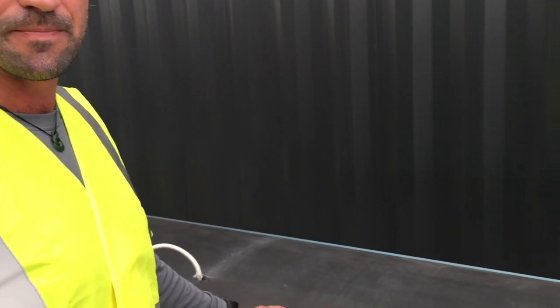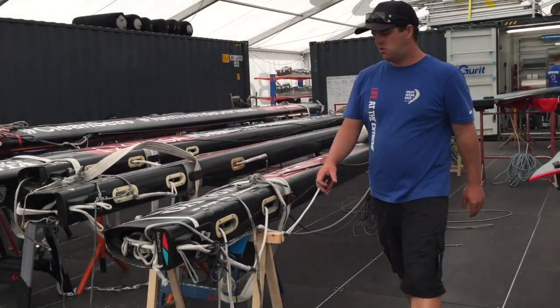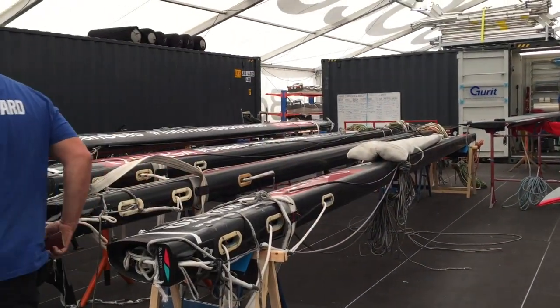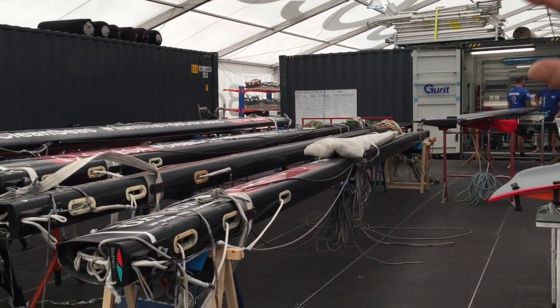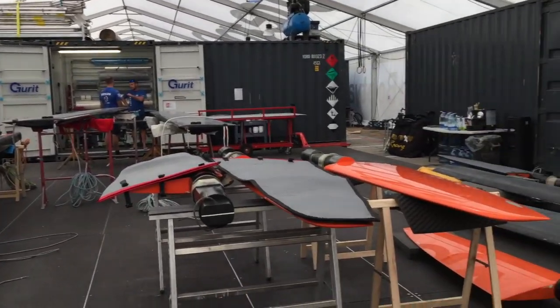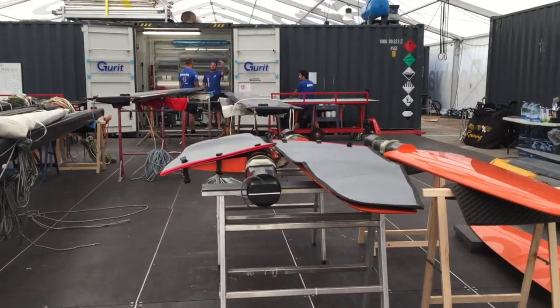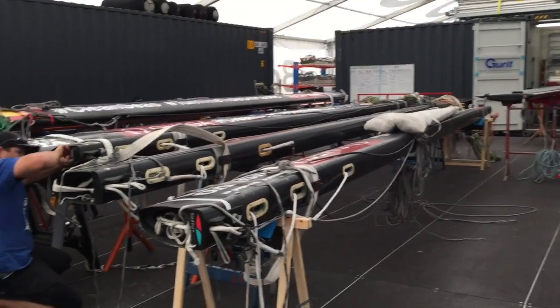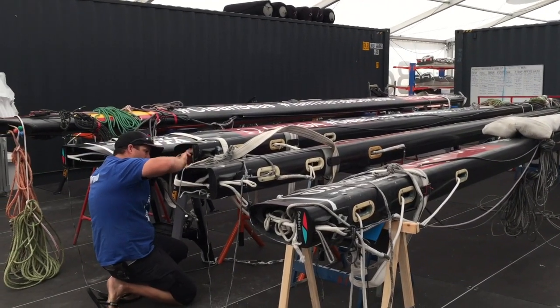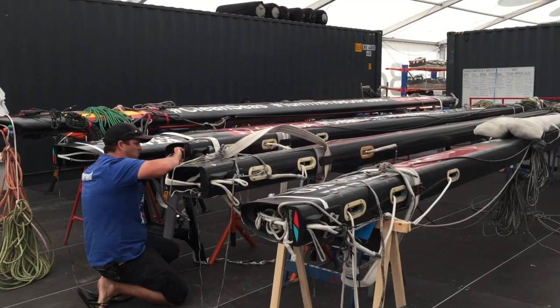The foils are all taped up here for repainting on the leading edge so you get a good laminar flow over them. They normally get a solid three or four days of work. This is our boom, and these are our rudders. The NDTs will check through the booms, the foils, and pretty much everything for inspection. This is Timmy — he runs the boat building side of the boatyard, so if he picks up an area of concern, he'll flag it with the NDT guy so they can look at it quickly and get the repair done.